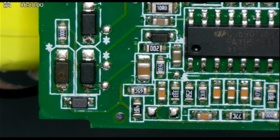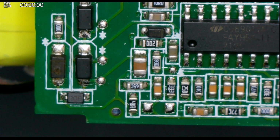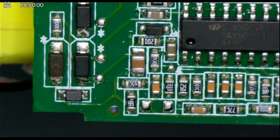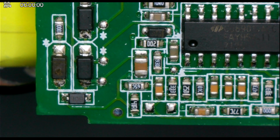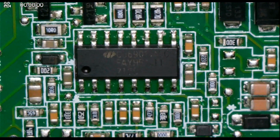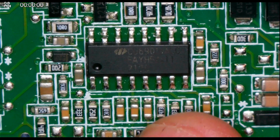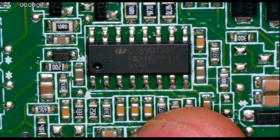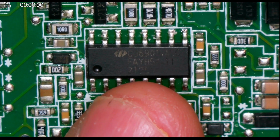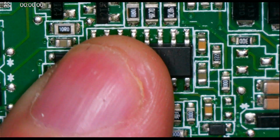I don't actually have an SMD equivalent. Was that SS16? So I've actually put an order in for that. I've also ordered this IC. I went round and I took some diode measurements with the leads reversed, red probe on ground, and the readings I was getting round the chip all seemed as expected, with the exception of 15 and 16.